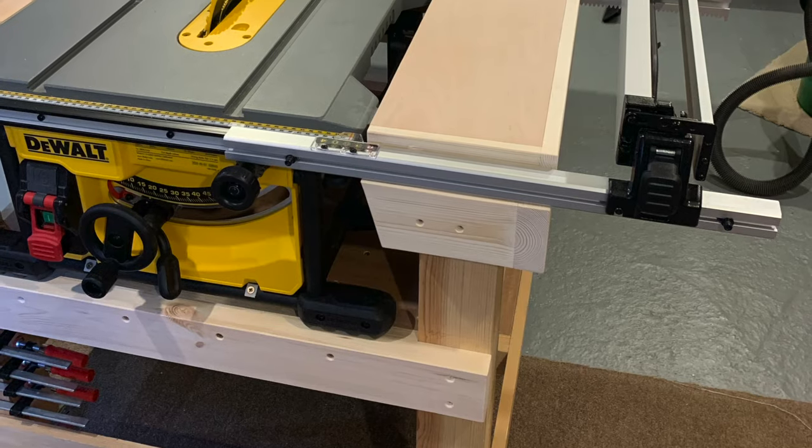As you can see the wings on the left end side fit quite closely and are all part of the bench — a lot of people thought they were separate, they're not. As I say, the cut out along the back has to be there to allow for the rack and pinion to slide freely, and that goes right the way to the end and stops with about a quarter of an inch to spare. The beauty of this bench is it's double thick — because I already had a bench here with 18mm ply, with another layer of 18mm ply this is now sitting at 36mm, so it's really really sturdy and completely flat.